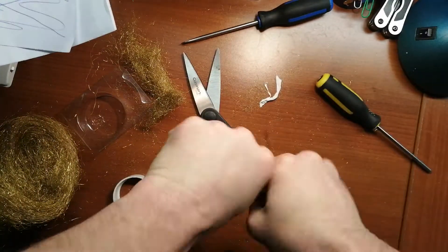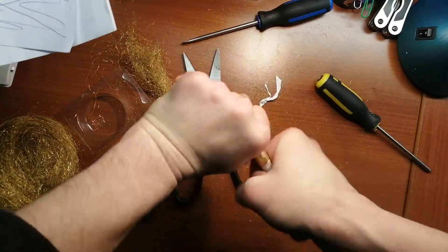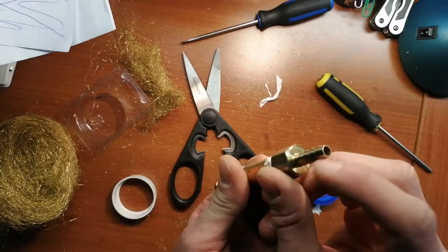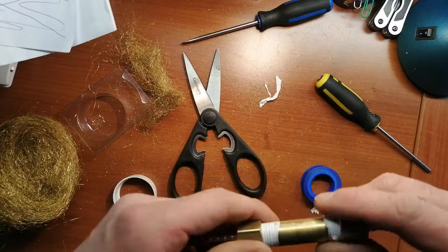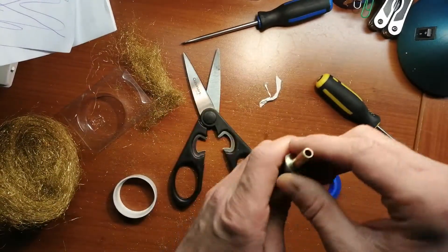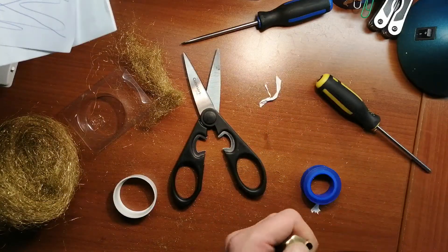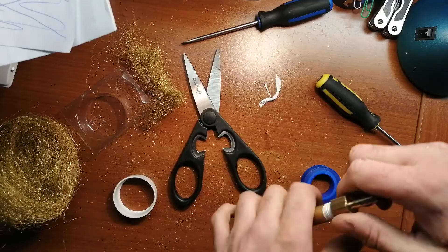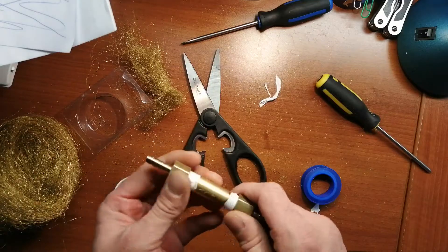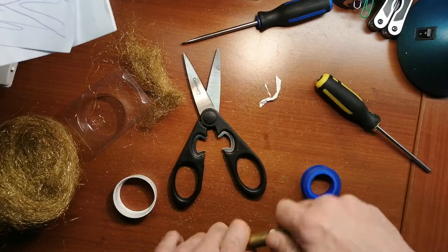When you tighten it down, it'll be nice and tight and you've got no air gaps anywhere in there. You've got a nice solid flashback arrester. You can clip onto each end, and when the explosion happens and travels down the tube, it'll stop in here. You want to put a few drops of water in there before each use, just for extra protection. It's not going to mess with the gas flow — it'll just push it through anyway. You want that brass wool nice and damp.